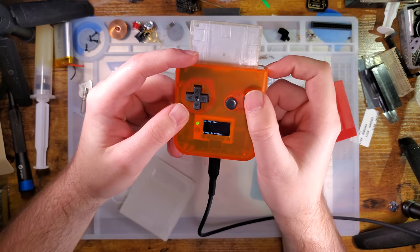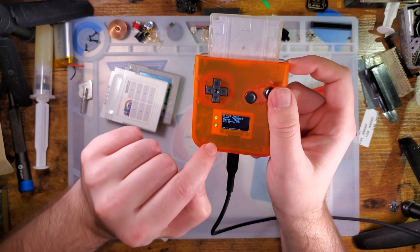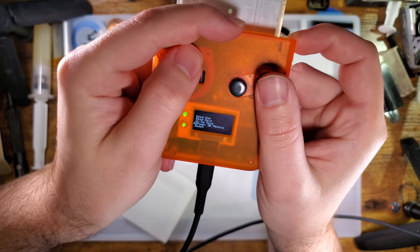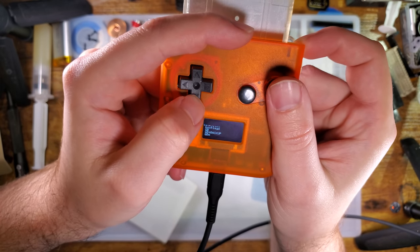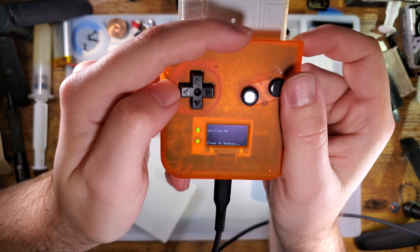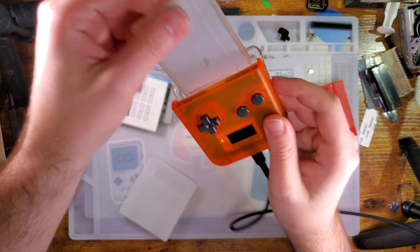It resets back to the main menu instead of the Game Boy menu loop. You see it's reading from the cart — now it sees Pokémon Silver. Let's go ahead and write the save as well. GB Save, Pokémon Silver — verified okay. Excellent. So one of the things with these carts is they use FRAM instead of SRAM, and because it's using FRAM I don't have to have a battery in there to retain save data. The battery is required for the real-time clock, however.